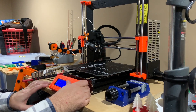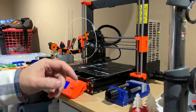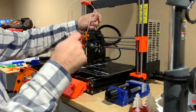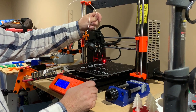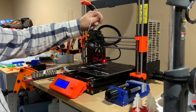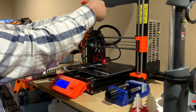At this point we can go ahead and get ready to heat this thing up. I'm going to select PLA — won't have to get nearly that hot — and start pulling on this. I'm going to start pulling up on this while I heat it up and continue to pull on it while it's heating up until it comes out. Okay, it's heating up now. I'm pulling on it; it's not moving but it's heating up really fast. 42 degrees, 50 degrees — I'm just pulling up slightly, not super hard. 60 degrees, 70 degrees, there it goes, it's starting to move. 80 degrees, 88, 90 — there we go.